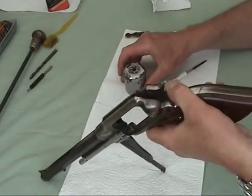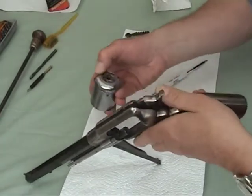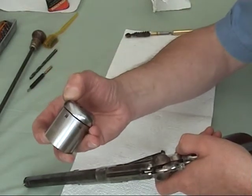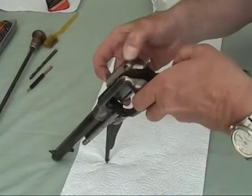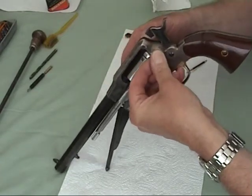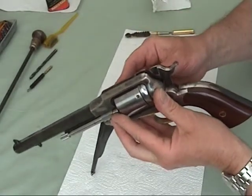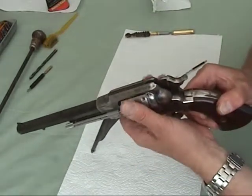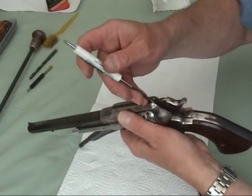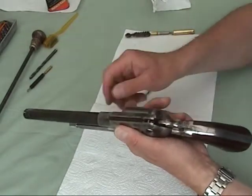When relocating the cylinder and back plate, I depress the firing pin with my right hand and hold the whole assembly as I'm showing to you now. As I insert the cylinder back in, with my left hand I push the hand back into the frame, and this enables the whole assembly to then slip back into place. You will hear a click as the firing pin relocates in the hammer notch area. The firing pin centralises the back pressure plate.